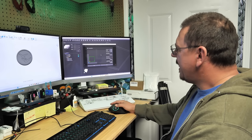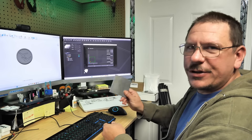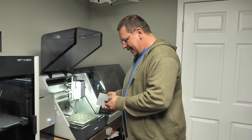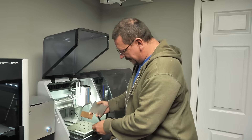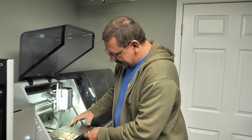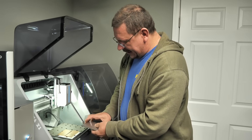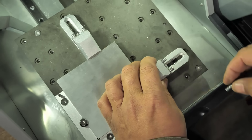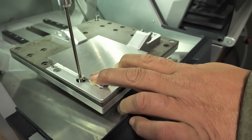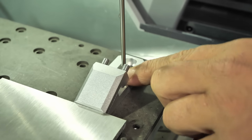Now that we've got this window up, as you can see we're starting in the corner. I'm going to take our stock and show you how to put it in the machine. Now we're over at our machine. One thing you need to do so you don't mess up your bed is put some pieces of block down underneath, in case our bit travels too far and doesn't hit our bed — it'll cut through into our sacrificial board. It's very important to make sure the material doesn't move around; if it does, it's going to mess up everything. Always be careful where you're putting your clamps to make sure you're not going to run into them as you're cutting.